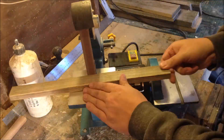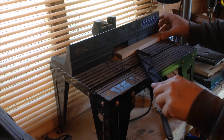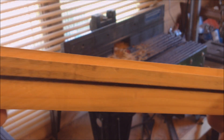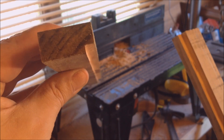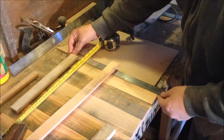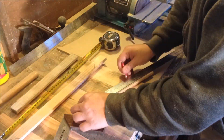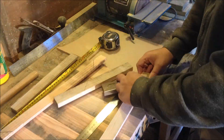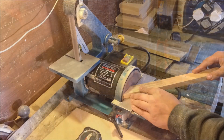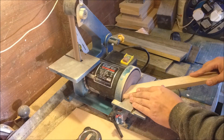Quick cleanup. I'm just cutting out a little groove here so I can fit a piece of MDF in there for the chalkboard — I think they're called rabbets, I have no idea why. Now just measuring out the frame for my chalkboard, doing a 45-degree cut for each corner. Cut your groove out before you do that cut for a neater job.